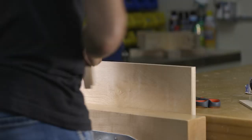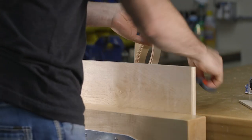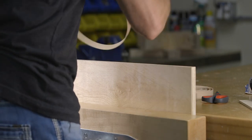Now that you're familiar with the edge banding material and some of the trimmers, it's time to dive into the how-to. To get started, cut a piece of the edge banding slightly longer than the plywood itself — about a half to an inch on either side is fine.